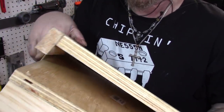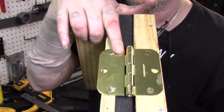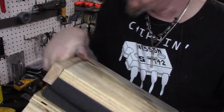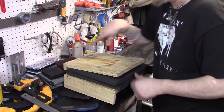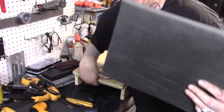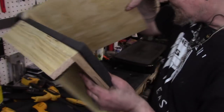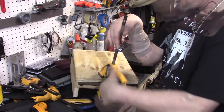It's real easy — it's just a piece of wood cut small, then the 12 inches hang over. I made the hinge hole longer so as you clamp it, it can give and take. The clamp is just to hold it in place so the top piece doesn't go flying around. You can see it can go up and down, so when you clamp it, it clamps down and gives you more pressure. I keep these pieces loose so I can move them around. The bottom is just the same piece with two slots so you can fit the clamps in, slide it down, and you've got it.